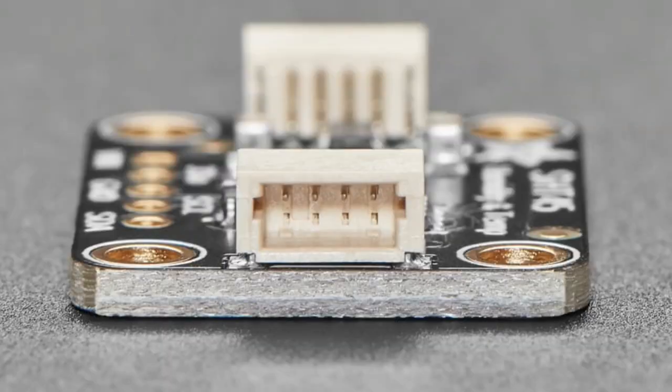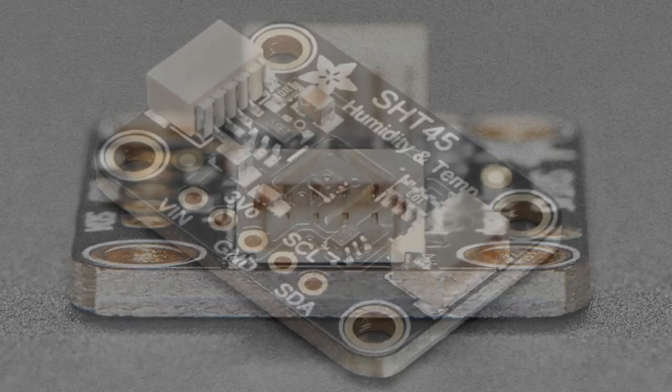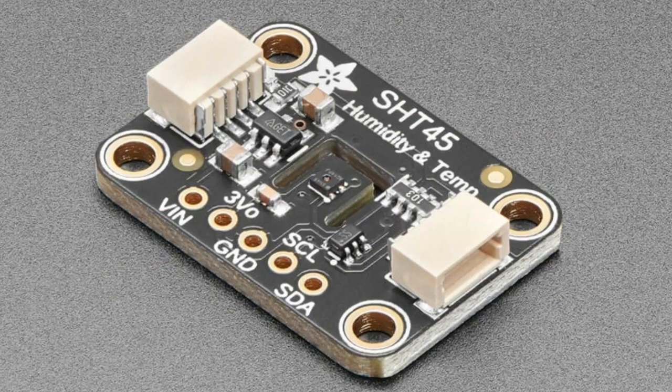They're very simple. They only have an I2C interface. But we've got Arduino and CircuitPython code. You can't change the I2C interface address. It's only 0x44. That's the only thing that comes in. If you need to connect multiple of these, you could use our I2C multiplexer. We have the PCA9548 and PCA9546 in the store, so you could plug and play those if you need to have a bunch of them. But they're a little more expensive because they're higher quality.